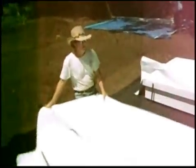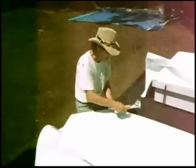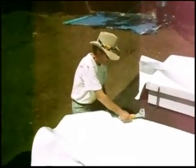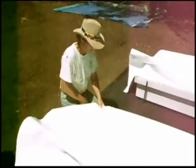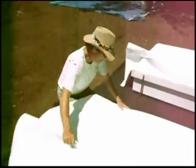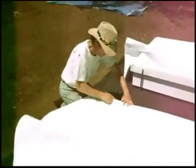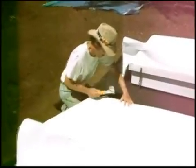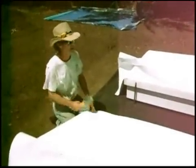I'm going to go to one end of the trough, grab the liner by the edge, and again make the edge of the liner even with the edge of the two by four. At that one point where it's even, I'm going to put in a couple of staples. I'll bend it back so it's even with the edge right along here, and put in a couple more staples.